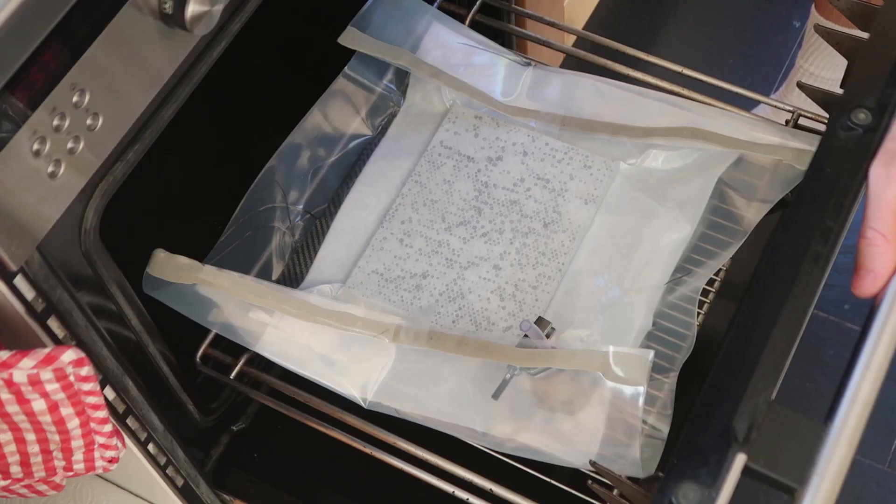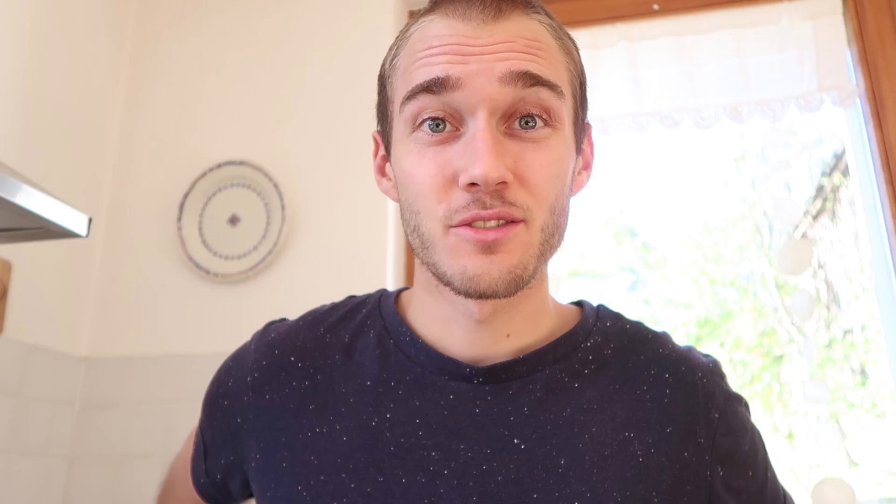Let's make a little experiment. I used to bake cakes in my oven, but that's completely old school now — I'm baking some laminated carbon fiber pieces. This is crazy, man. So just to be clear, I put it in the oven at 50 degrees Celsius, so it will take about three hours to harden instead of 24. So that's cool.